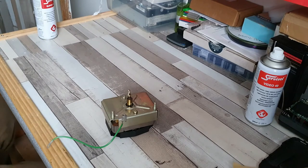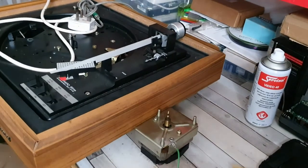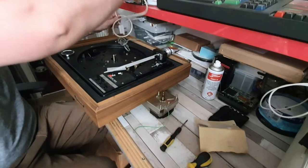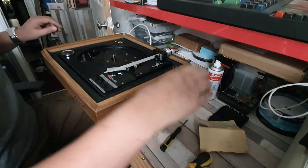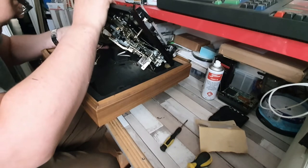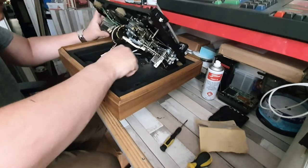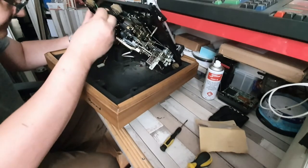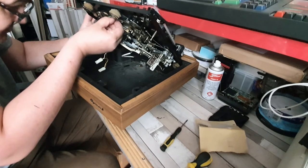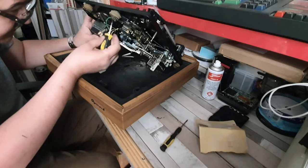Let's see what it does when we put it back into the chassis of the unit. Here's the unit - and the motor comes up and out. There is literally just the rubber buttons that it plugs back into, like so. That puts the motor into there, and we have the earth lead which goes back onto here. It's very important that you do earth it, otherwise you effectively make the entire chassis or motor live, or blow a fuse - one of two.